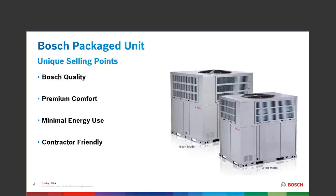Minimum energy use — we're looking at probably less than a 1.5 amp draw every time we start up with this machine. The target amp on the 3-ton is somewhere lower than the 10-amp mark, with a red flag at 15 amps. The target amp on the 5-ton is around 14.5 to 14.7, red flagging at 20 amps. Very, very low energy use on this particular machine.